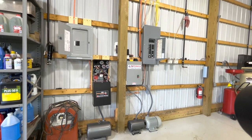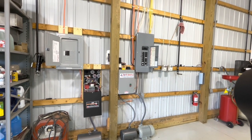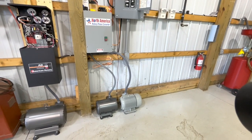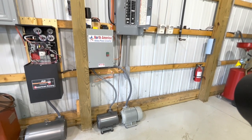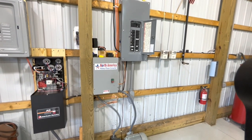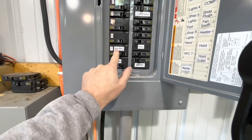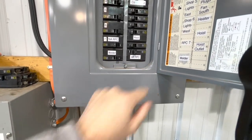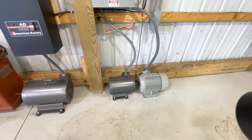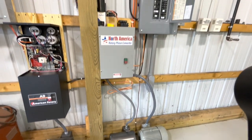Here's an overview. You can see the converters here. The one on the left is the balanced phase converter that I use for the CNC machine and any future CNC-controlled machines that I get. Over on the right-hand side is my original one, which was just for running my Bridgeports and lathes and the older-style non-electronic equipment. The electronics is what really is the factor in these new machines that needs the balanced power. I've got a breaker for each one of the phase converters. This is a 5-horsepower unit that we upgraded to a 10-horse, so there's two 5-horsepower electric motors.